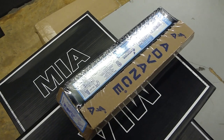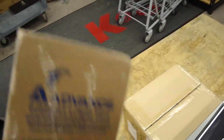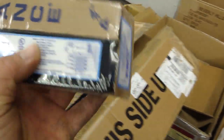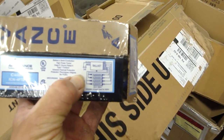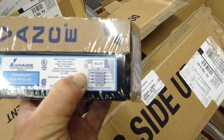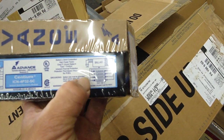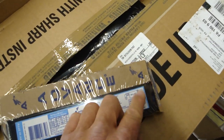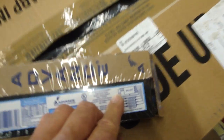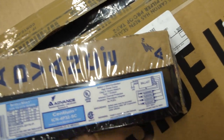And this system here has a three color coated set of secondary wires out of the electronic ballast unit. What we have here are two yellow wires. Each one comes from the ballast and needs to be cut and then capped again, wire nutted, on each of the two yellow wires, and then two red wires and two blue wires. They all come out of this electronic ballast, and your mains are on that side. So you have six wires that come out and go to the lamp structure.